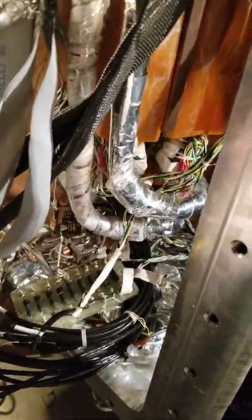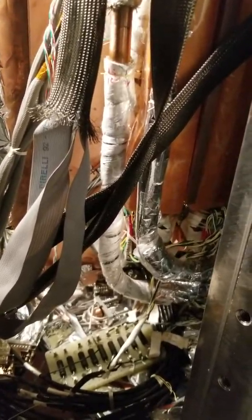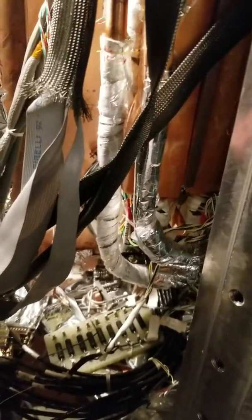Where does the metric start? Everything coming down from the stack up here. Was this built in Italy? Yes - that's why everything was metric. We couldn't get sweat fittings at all. I can buy metric tubing but I just converted it, and once you convert it, everything is easy to get. You can just get regular half-inch plumbing couplings - spin tight would be nicer for this.